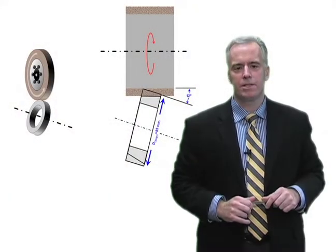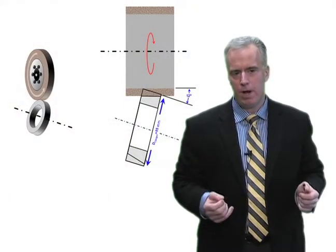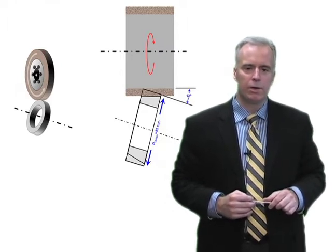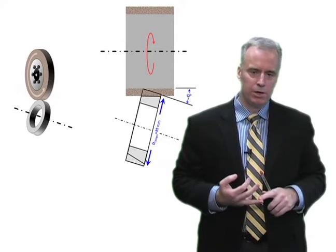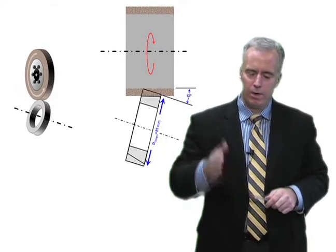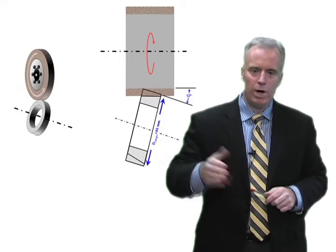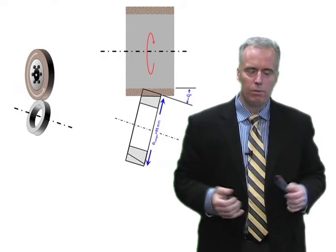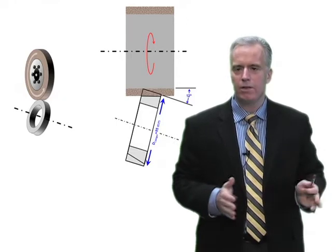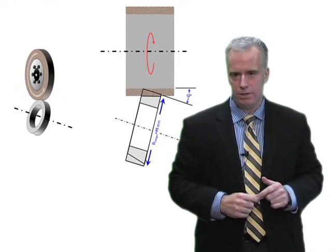Here's a company I visited a couple weeks ago. We spent an afternoon on the shop floor looking at one of their grinding operations. They were grinding carbide, doing cylindrical OD grinding — grinding these carbide rings, plunging in and then doing a wipe right at the end. They had just got a new wheel they liked and said, okay, we got to find the sweet spot. What's the quickest way to do it?